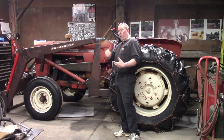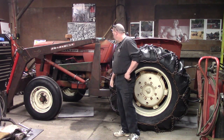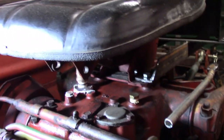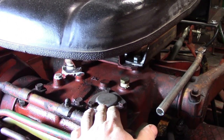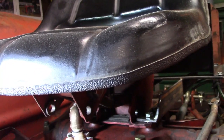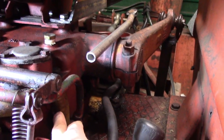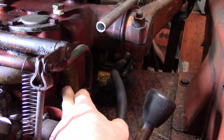The hydraulic pump draws its oil out of the transmission — but that's not the case on this machine. It has a separate reservoir. That reservoir is right under here. You can see the strainer housing filter — strainer right there — and where you fill it, where I now have a 90-degree fitting. This green tube here is your suction line for your hydraulic pump.